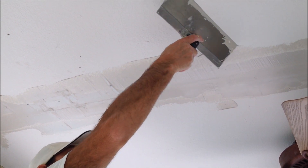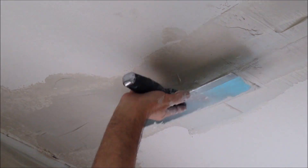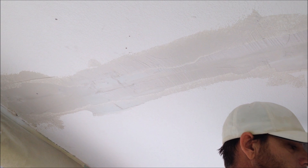I am going to skim coat — that'll be in the next video. A screw's a little high, so I'm just going to add some mud. You want to keep it nice and smooth as possible so that you don't have any sanding to do. You can just maybe scrape some high ridges off or something like that. I don't like sanding — maybe you do, let me know in the comments.